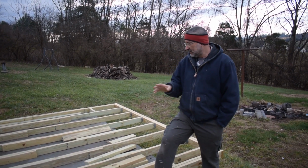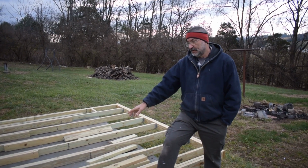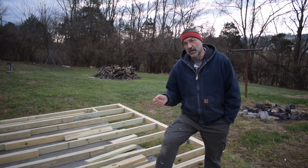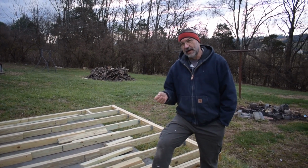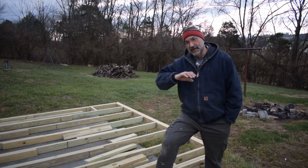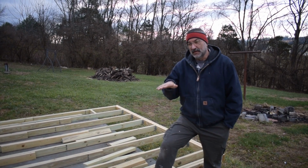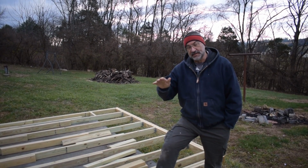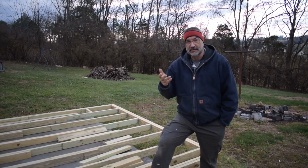And he tells me, you know, I've got this all laid out down here, that pressure treated lumber can no longer have ground contact, and it can no longer have contact with concrete. If you use pressure treated lumber for sill plates around the house on top of the foundation, you've got to put sill seal on it, which I always did anyway, but it's required now.